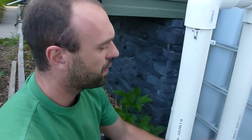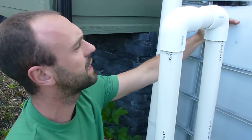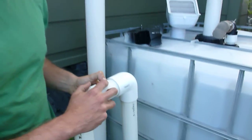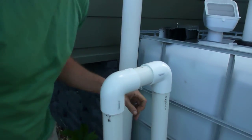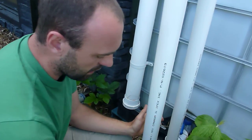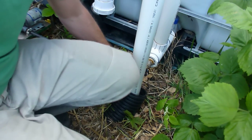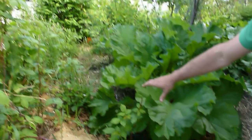The top part of the tee fills a two-inch pipe, and we set the elevation of that two-inch pipe so it allows the tank to drain once it gets beyond a certain level. One really important detail: on top of this overflow we drilled a little hole. This hole prevents the tank from siphoning all the water out in one go, so the overflow doesn't come out all simultaneously. The last thing to think about with rainwater harvesting is managing the overflow — you can see it goes into a small weeping tile here that runs all the way through the food forest and feeds the bottom of our swale, where our swale and our trail are one and the same.